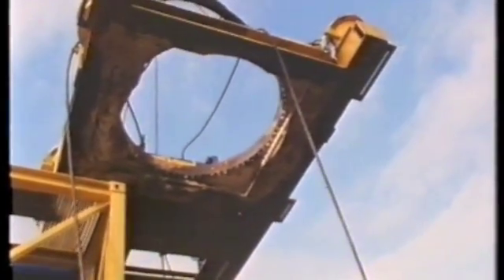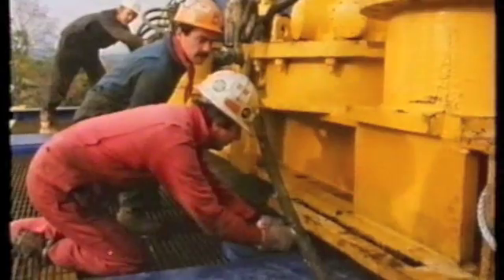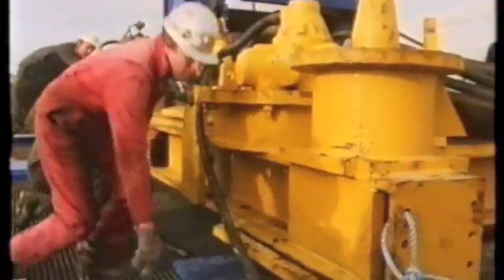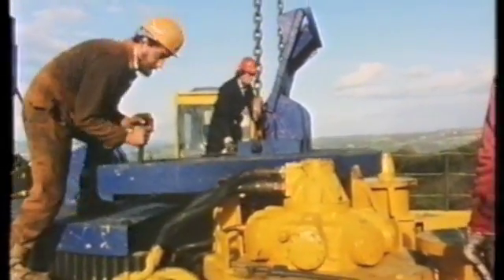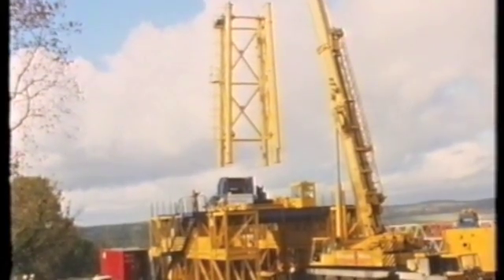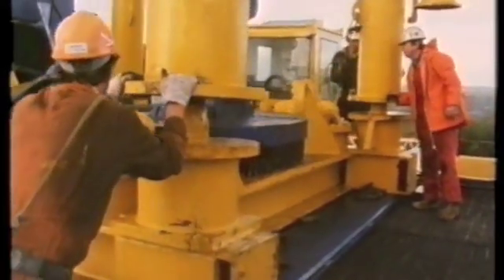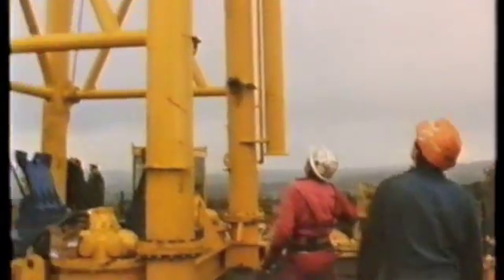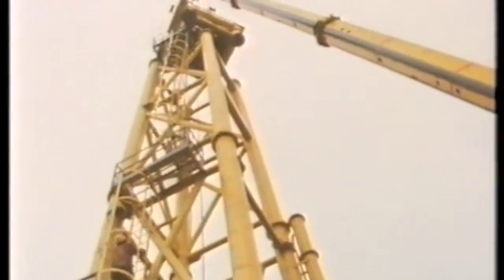The rotary ring and dual drive motors are mounted on the 30 ton main rig base frame, on which is also fixed the winch unit. This is accurately positioned on top of the substructure. The rotary drive plate is in two halves to enable the assembly to be brought to the surface. The Titan has a three-sectioned mast, these making the largest dimensioned units to be transported to site. The total derrick height is 24 metres above the drilling deck, the final lift being the crown block — an awkward lift at full radius and height of the crane. It is 18 tons in weight.